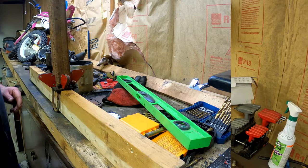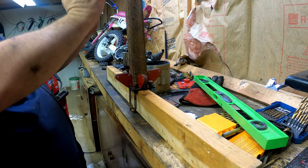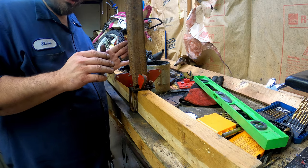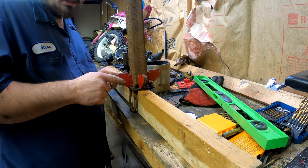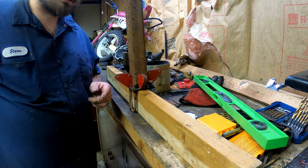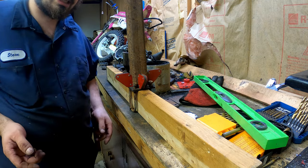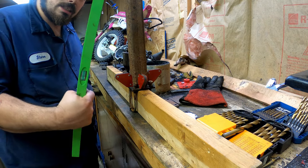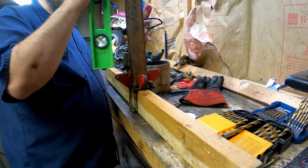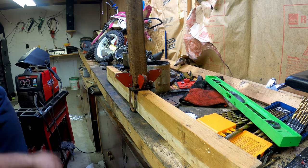Brackets for the lift block are done. I did this off camera to see how I was going to level it out and make sure it's straight up and down. It looks pretty good eyeballing it, and we got our magnets holding it in place. If you don't have some of these magnets for doing this, get some — check out all of our links down in the description. I'll throw all kinds of cool stuff down there that'll help you fabricate. We're not all rich, we don't all have CNC tables, but we can get these. It's level all the way around. I leveled the base out before we started. So let's tack weld it in place and then we'll get the top one on.